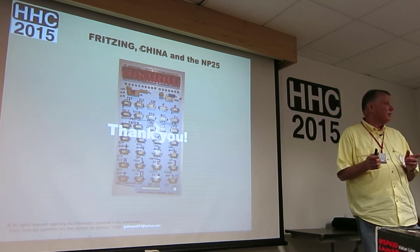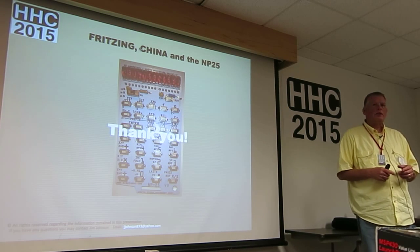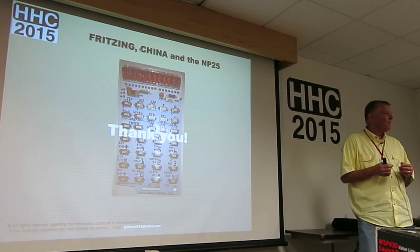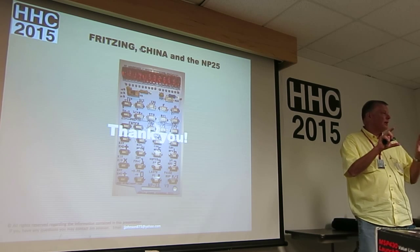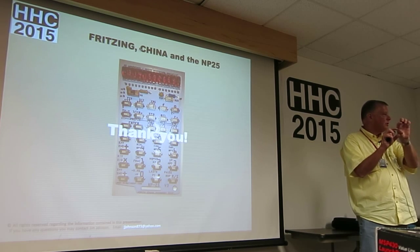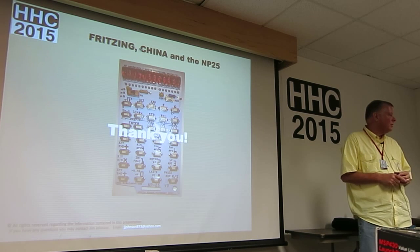He's doing an HP-41 development. There are discussions on the bulletin board and on the HP blog. Is he the one talking with the Chinese person about the special display? Yes. Right now he's making a custom display. He's put two development boards together and has it scrolling across two separate LCDs, executing HP-41 code. They found a manufacturer in China that's going to make the same LCD — 14-segment — for like three bucks each, or something like that.